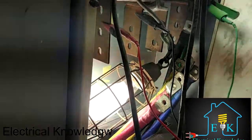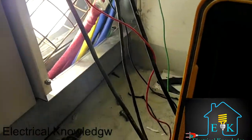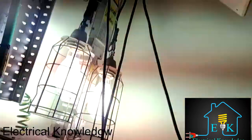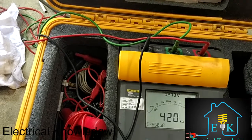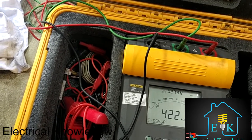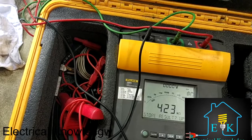We are injecting 500 volt DC, but it's not reaching 500 volts fully — that is the reason I can say this is not a good value. See, only 274 volts are going through. If 500 volts were passing, it would be a good value. The voltage, ampere, and resistance are all showing less. That's why I am saying this is a bad value, for your information.